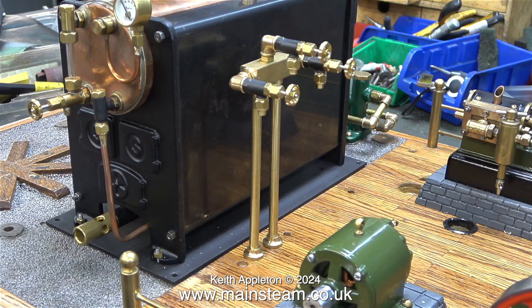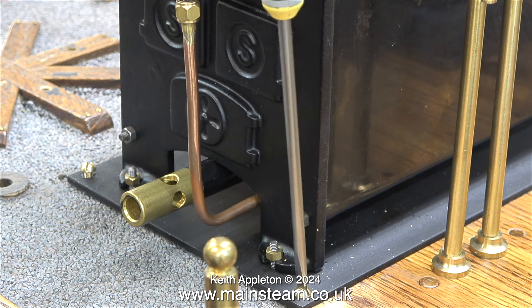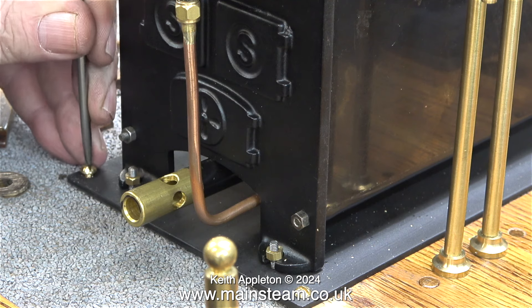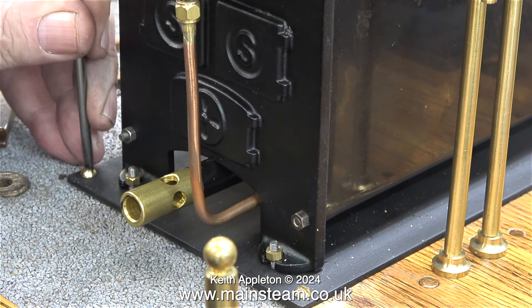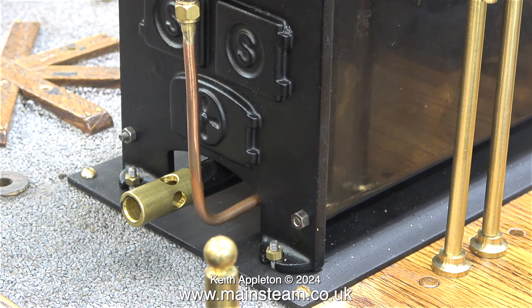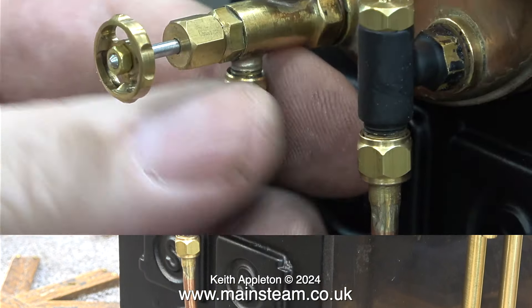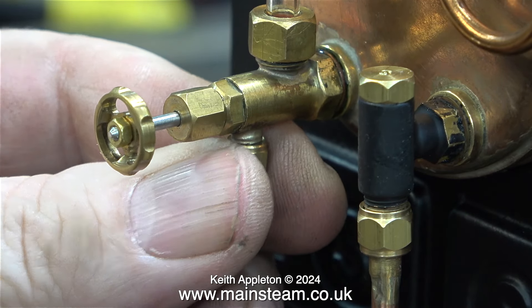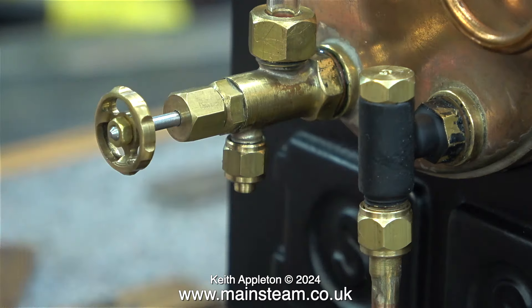By tightening the two 2BA bolts the turret is in the correct position. There are two holes in the baseboard, one either side of the turret mounting — one's been plugged and I will probably plug the other one to make them match. I think it's time to screw the boiler down to the baseboard. I need to make sure the boiler is solid to the baseboard so that when I fit the condenser it is fitted in the right place. I thought it was a good idea to fit a union nut and cone to the water gauge blowdown valve — it's pointless fitting a pipe because there's nowhere to pipe it to, it just looks better.